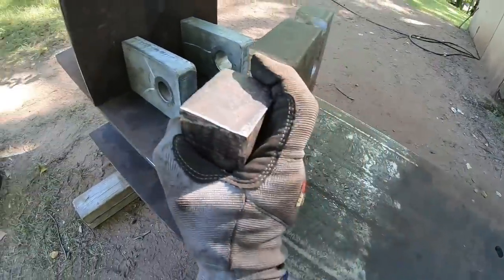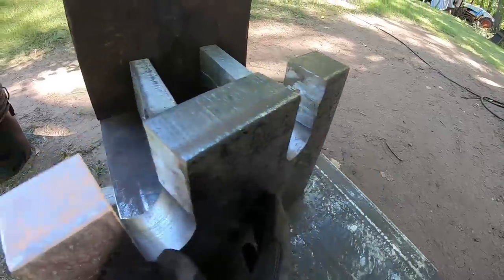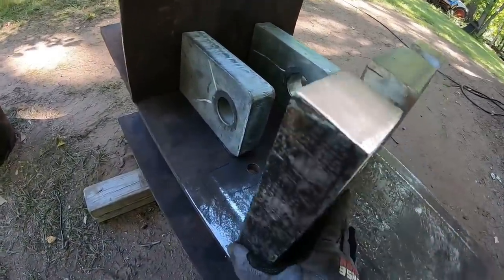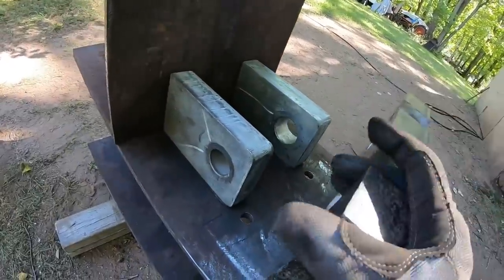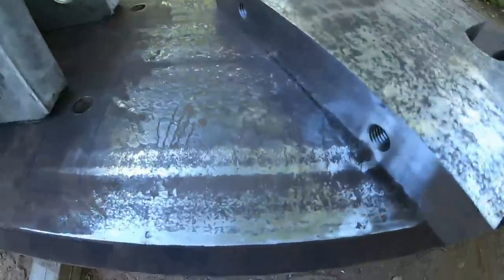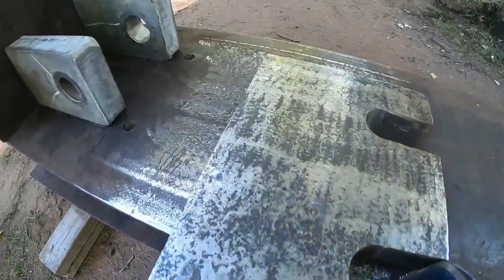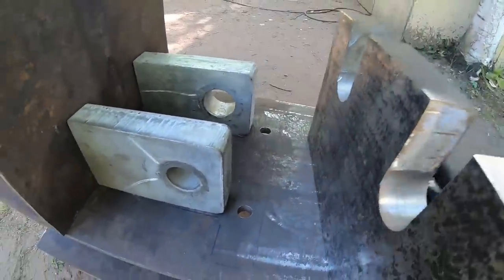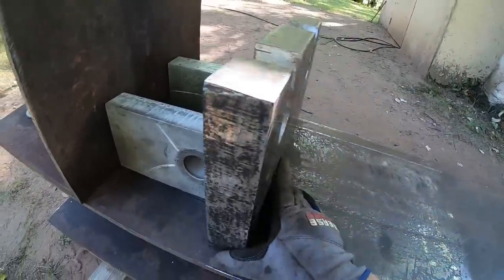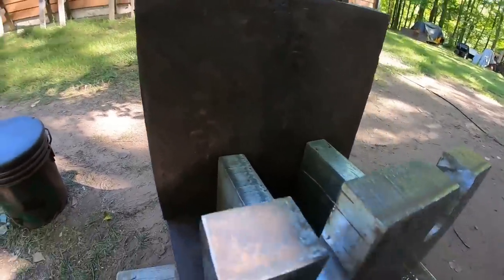That's what this is. 2-inch thick plate steel, and I have milled and cut a couple of U-shaped slots in it that are on center with the track pitch, so the chains and the bushings will slide down into that. And bottom of this I have drilled and threaded for 3/4 by 10 bolts, so this will be well secured in place also. Those bolts line in with that hole and that hole. And that is how they go up against the backstop, just like that.